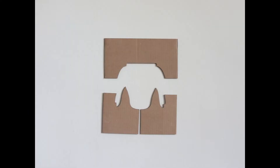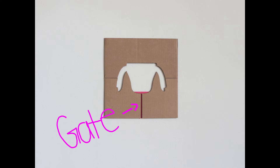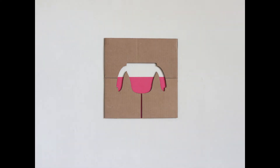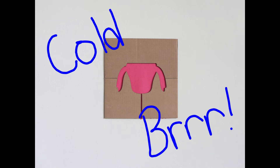Like I was saying, the two halves of the mold are pressed together and then the hot liquid is injected through a hole called a gate. The plastic is injected with a lot of force behind it to make sure it fills the entire mold. Once the mold is filled, cold water is circulated through the mold by the robots and the plastic cools down and the liquid becomes a solid.